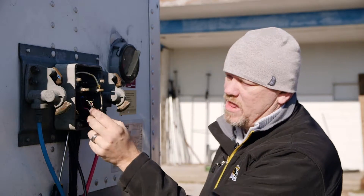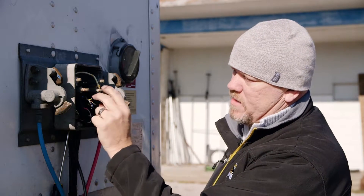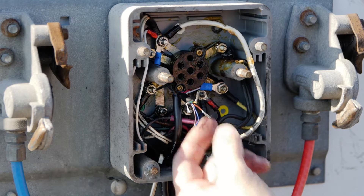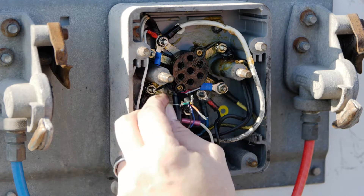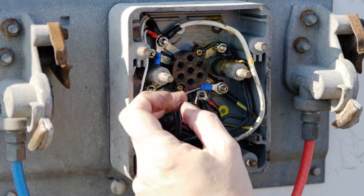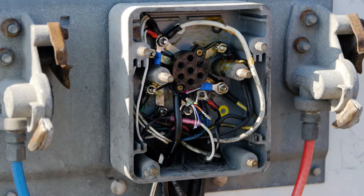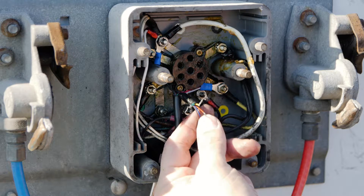Your green and yellow wire — those cannot touch. We want to make sure those are taped off and separate. Your other wires, the brown, blue, and orange, can simply be snipped off. It's definitely a must to make sure that the yellow and green don't touch even though we're not going to use them — one's an input, one's an output, and we don't want a signal running back through there. So these get wire nutted individually, and the other three will get snipped.